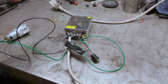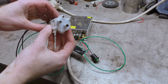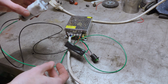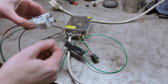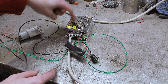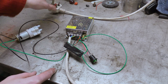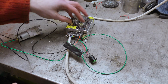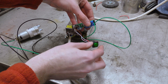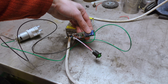This is what I designed - well, I say designed, I just put bits together - to run the pump. So I have a cheap diaphragm pump from eBay, I think this was three pounds from China, took a while to get here but it works. It absolutely sucks in waste oil and pumps it back out again. This is just an AC to DC transformer, 240 volts in with a UK plug, 12 volts out - I think this is a 5 amp or an 8 amp. And onto this bit, which is sort of the most important bit after the pump. This is the timer relay. This controls how on and off the pump is.